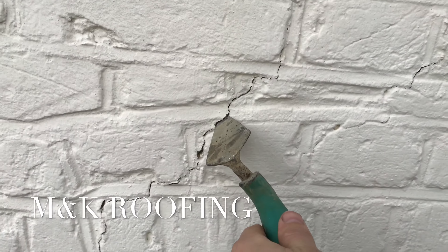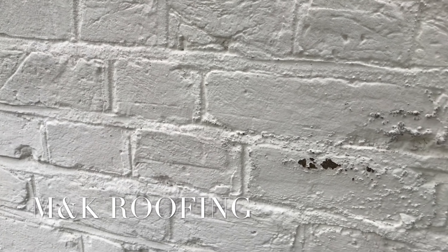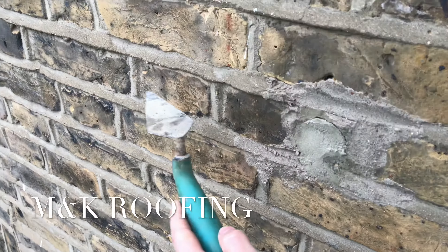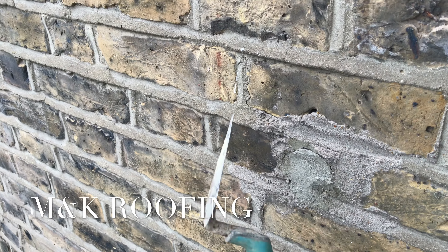With the yellow stock or the red stock, mainly in London properties or various parts of your building, you'll end up getting cracks. You'll be able to see here — I've got this at the early stage, which is quite good. These buildings don't have any cavity wall ties. Your cavity wall ties are these headers, which basically tie into the internal wall. With the yellow stock, they seem to absorb a lot of water, so when it's raining you get a lot of water soaked through these bricks. You've got about that much of a cavity but it still tends to touch the back facing wall.